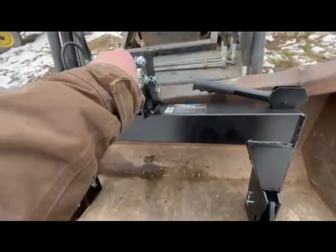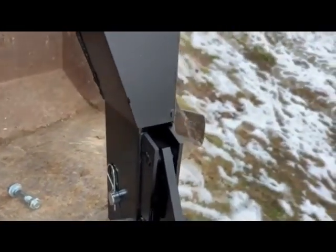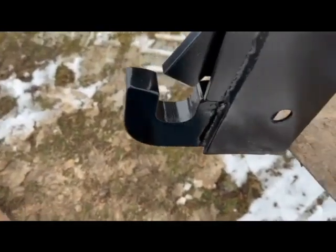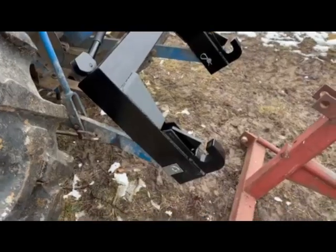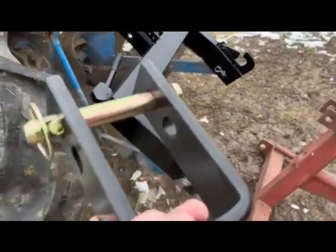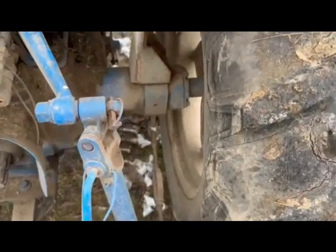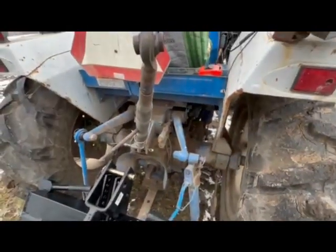So what we're going to do — we're going to grab a wrench and take these two bolts off and take this hook off. Okay, we got our bolts off. So the next step is there are little pins down here — we're going to pull these out. That's where your three-point is going to hook into. We're going to pull these out on both sides, and then this just hooks right into the lower arms of your three-point. So we've got these lower pins in. The next step is hooking this in, and the pin that comes with this is going to go through here. That's also where your top arm is going to hook in, so you've got all of them hooking up together.